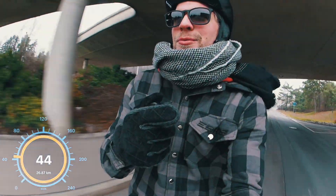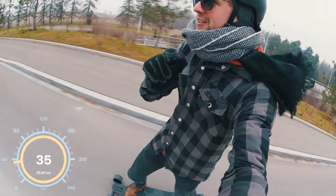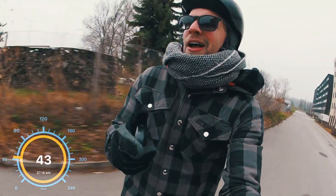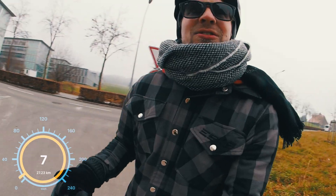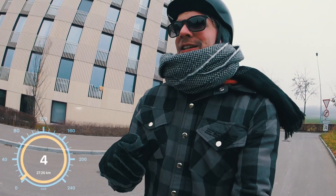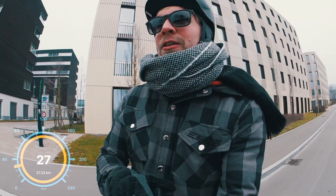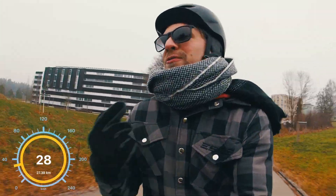I'm still feeling like I'm accelerating. Here's a little bump — now I'm going full speed on this nice street. Let's see how much speed I get on this setup. The brakes — maybe I just have to get used to it, but when you go downhill super fast, faster than 50 kilometers an hour, you definitely need a proper ESC. Not Ling-Yi, not May-Tech, whatever this is. VESC or Hobbywing — I'm not going for anything else ever. I think it was not over 45 kilometers an hour.